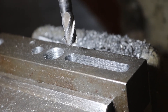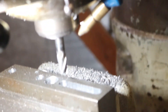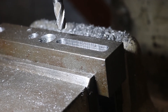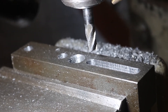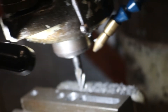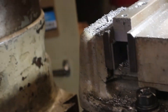I found another end mill and finished this slot out without having the camera in my way. I set up my little Noga Mini Cool there just to blow air on the cut to blow out any chips. I think that was my issue on the first try — I was recutting chips and they bound up and just snapped the end mill right off. It's unfortunate; that was one of my favorite end mills, but you'll have that. It's not the first one I broke, and it won't be the last. It's probably going to be a little noisy for you guys with that air blowing, but that's just the way we're going to have to play this.